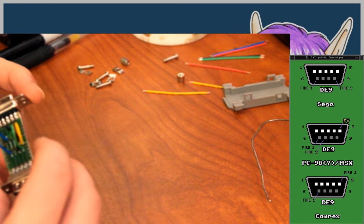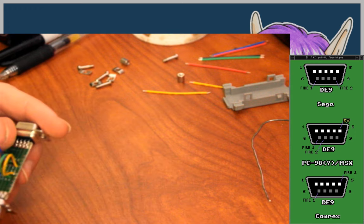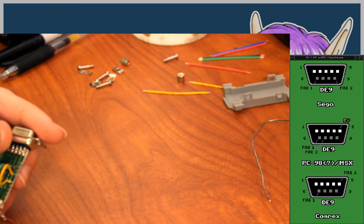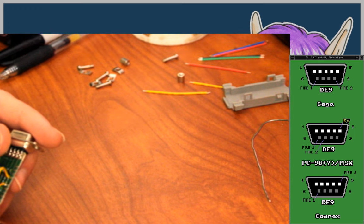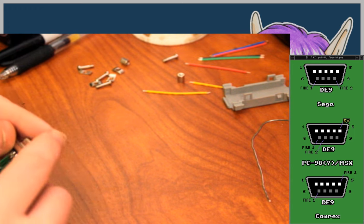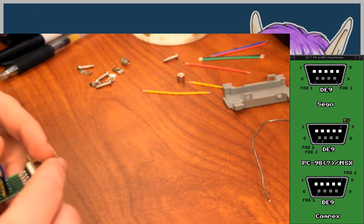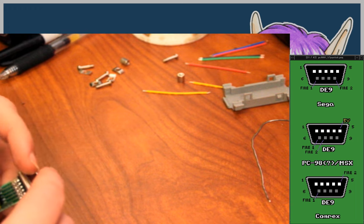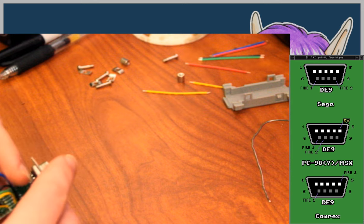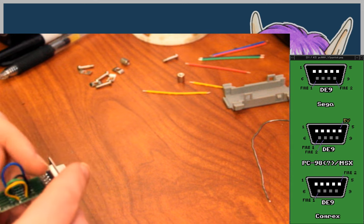Okay, so pin 8 for ground, but on the PC-98, I think that was pin 9? I hope I'm right about this. Hope I don't just damage something. I do have that bad 86 soundboard that I could plug in to test it.